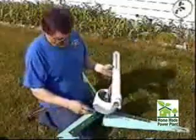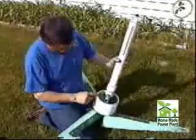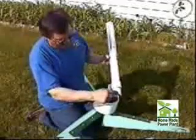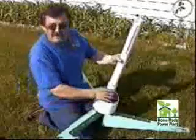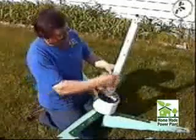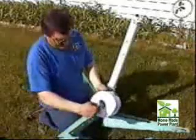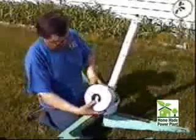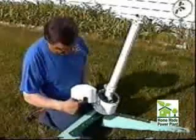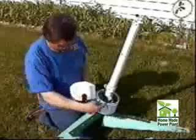Now on the tail, take the two-inch piece of pipe. Drill a hole with a hole saw the same diameter as the galvanized pipe. Saw it off — now you have a half moon. That will fit over the galvanized pipe; nice and snug fit. Mine sticks right on there like a spring. Now slide the collar over the tail. Drill a two-inch hole the same size as this in the back of the six-inch pipe cap, and figure out where this U-shape has to be drilled out. Drill a hole, cut it out — same size as that pipe.